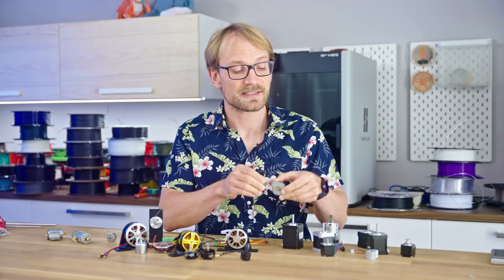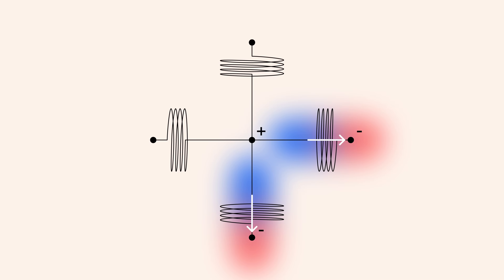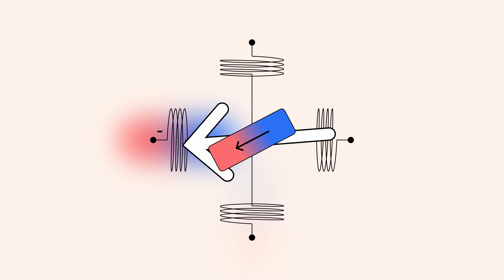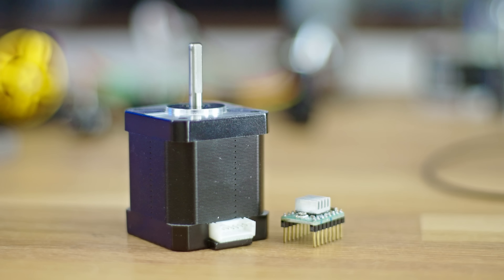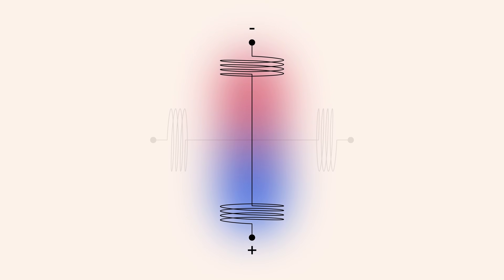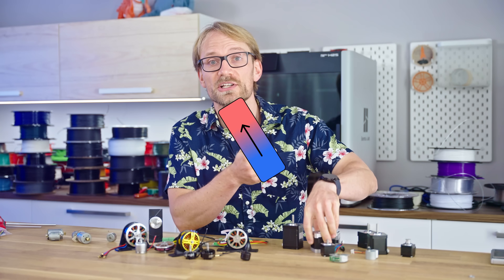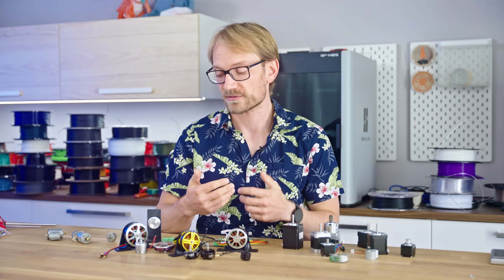Each step of that sequence is a full step, but you could also do half steps by turning on two sequential electromagnets at the same time, essentially overlapping the magnetic fields and creating an in-between position. Today's hybrid-type stepper motors rely on the fact that nowadays we can build much more complex and more powerful drivers that can easily reverse the current through each coil, so now we're using 100% of the coil instead of just half at best. That makes it more efficient, and microstepping logic and the current control that modern drivers can do has much improved, even just the last couple of years.